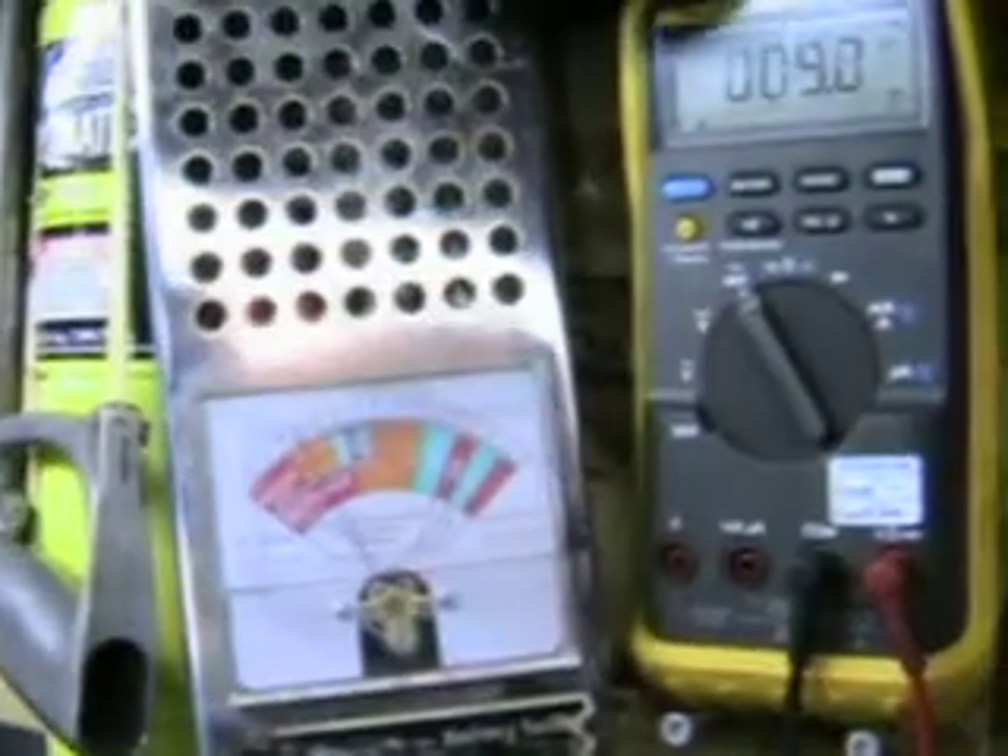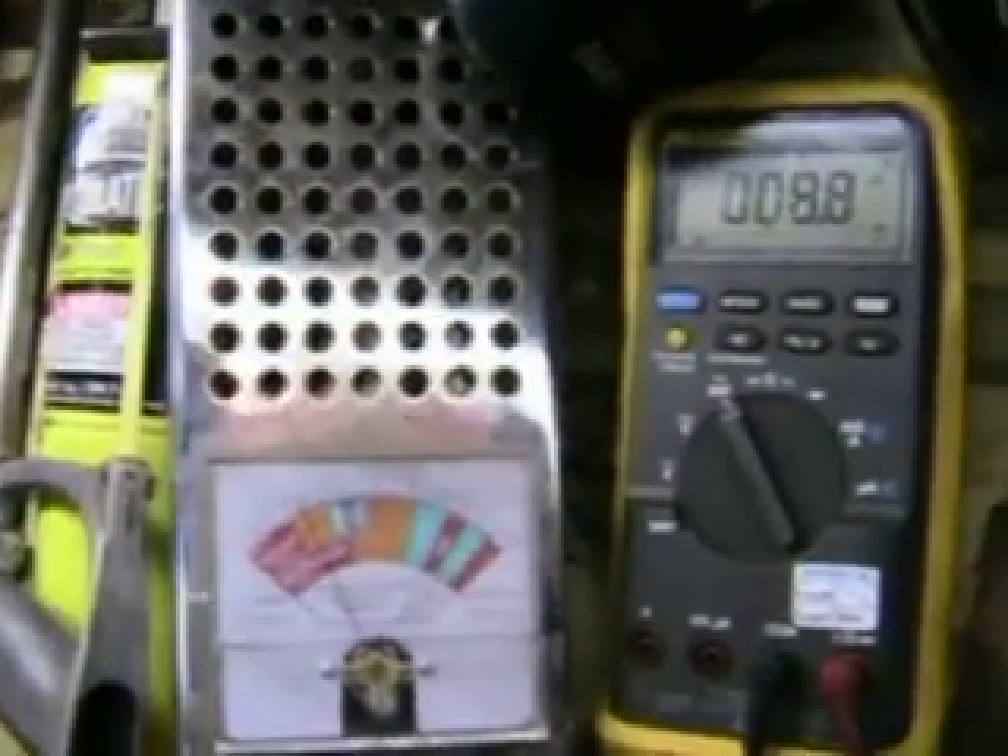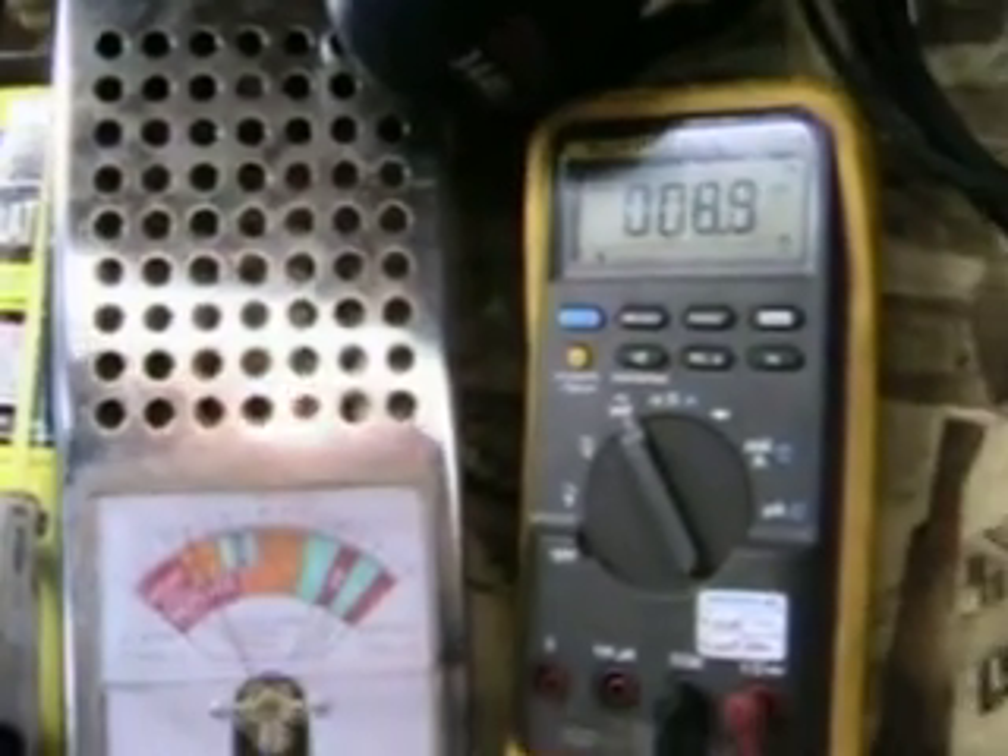I'm only running about 4% KOH. Just takes time now — about two and a half minutes worth of time. You can see it is going up slowly. Meters are staying pretty steady. My shunt — while this thing's cooking — is 5 amps for every 2 millivolts, so it's not too difficult to figure. Back up to the production.